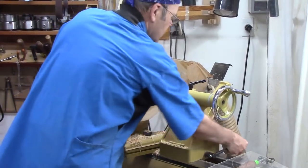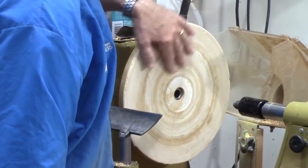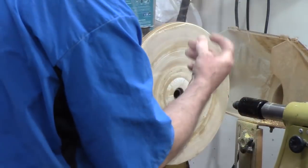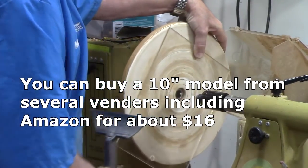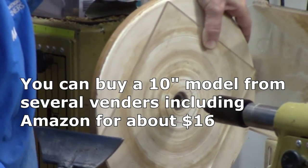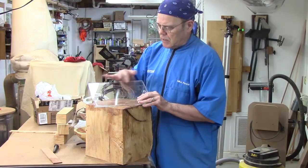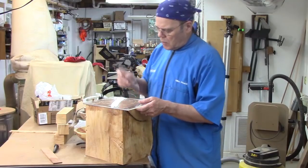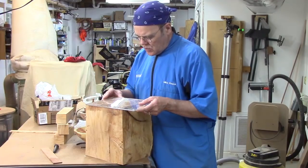I use this backer plate for removing the bottom of bowls. It's just a round plate with a threaded wooden glue block and some fun foam — one sixteenth inch closed cell foam. Basically you could put this on, bring it in, tighten it up, and then scribe it. You could cut it round, but I just didn't see a need for that. Once you get them scratched you can fill them in with felt tip pen or something and clean it off. What I like about this — and I have a smaller version for smaller blanks — is that you can better see through it and see the wood, giving you much better positioning.